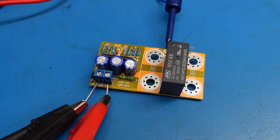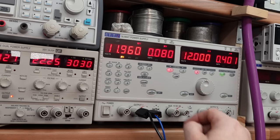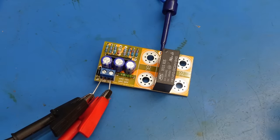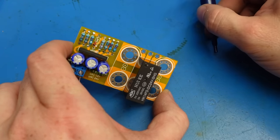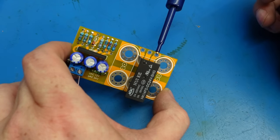Let's try it at a higher voltage and see if it is quicker. I'll turn that output off and scroll this up - let's put like 12 volts in. We can see the relay is powered back on - 20 milliamps, that's the current when the relay is powered up. Let's see how quickly it reacts. Oh, a lot quicker! Just check the other channel - just wait for that to reset. Just gone. There we go. Now putting 1.5 volts on here. That's working great.